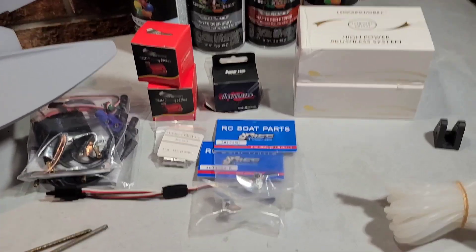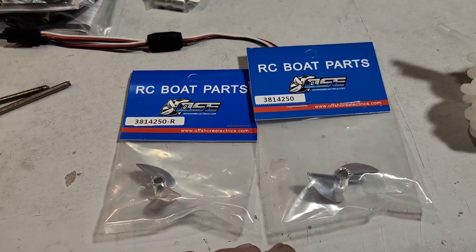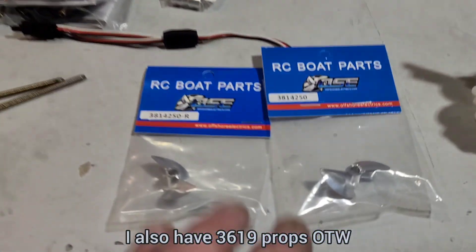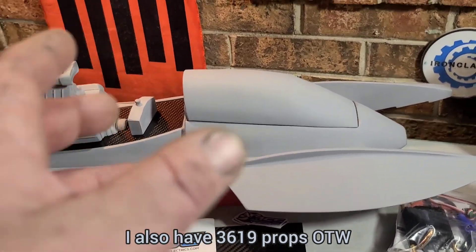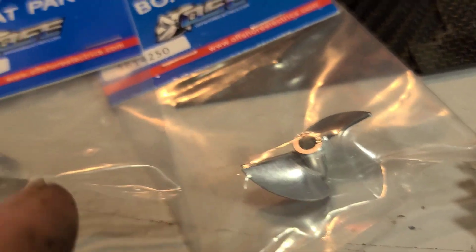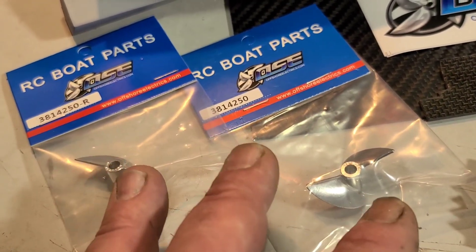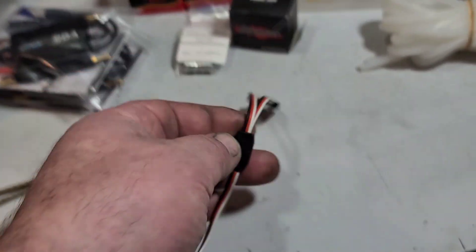I went with Offshore Electrics CNC 38-millimeter 1.4-pitch propellers, counter-rotating, and we'll have them spinning outward - not inward - kind of like a TFL boat for stability. If you have them spinning out it actually gives the boat a lot more control in a straight line. Aluminum props are easy to modify because I may need to take down the blade area or de-cup them. They're easy to file and finish, lightweight, not so sensitive to balancing - so the CNC prop should be a good start, 38/14.